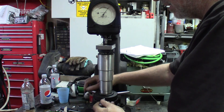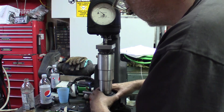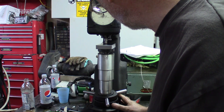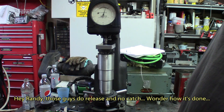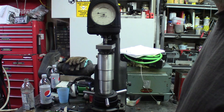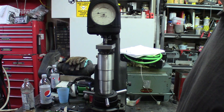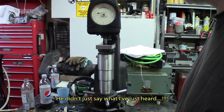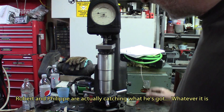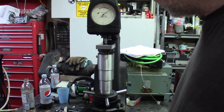If you want to spare your diamond — which costs a few hundred dollars — bring the piece into contact gently; don't crash the diamond into it. We apply the preload, release it, and wait about five seconds for the diamond to finish its penetration. We take the load off, disengage, and we're getting about 15 Rockwell — that's the pre-hardening, annealed state of the K460.